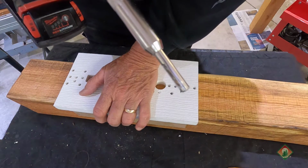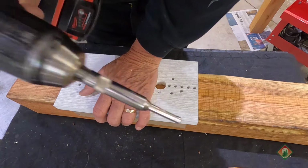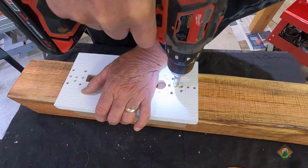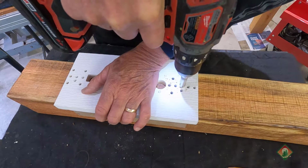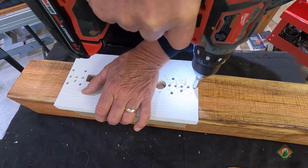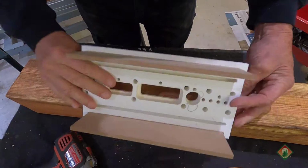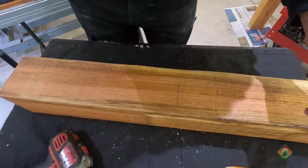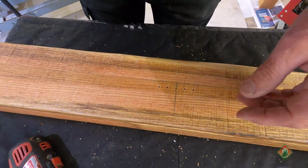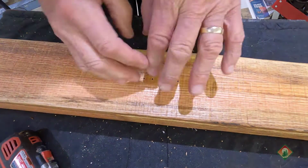and then all I'm going to do is this is that 7/64 snappy hinge bit, which again has just a little under a 1/4 inch OD on that outside. Again, if you're uncomfortable with it moving, you can just put a simple clamp on it, but again, as long as this was made to 4.5 inches, then this is going to hold it right on there. So now you can see I have 5 holes right there, right? And then it's a matter of using those holes for different purposes, okay? But all we're going to do is take them over to the drill press for this particular step.